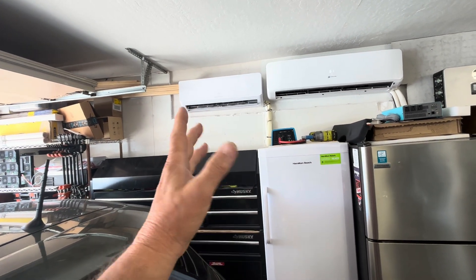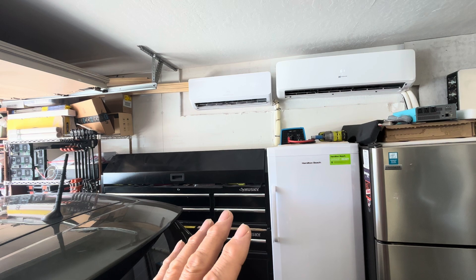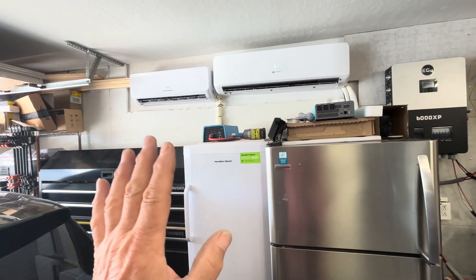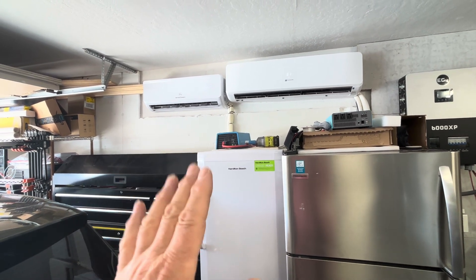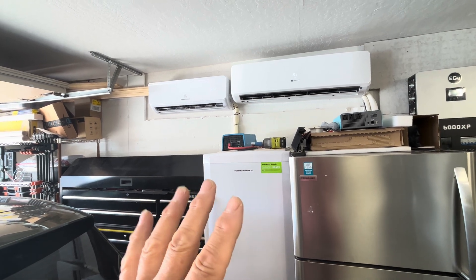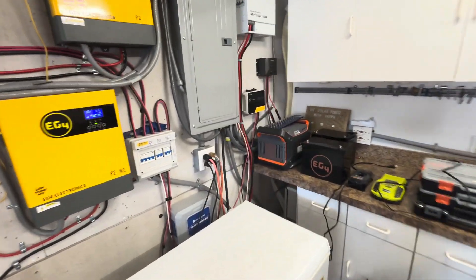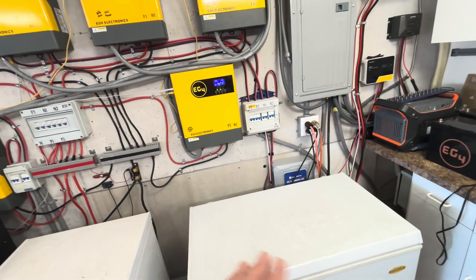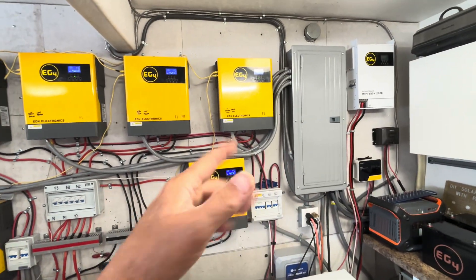You can run this thing with about 1,200 to 1,700 watts of solar or less. I have 12 100-watt solar panels connected in series. You want to stay above 90 volts DC solar panel input and below around 380 volts, staying right below 18 amps coming in. I also have it plugged into an outlet using a 12-gauge extension cord so if there are clouds it'll make up the difference — but that's actually my off-grid solar system, so I'm not even using the grid.